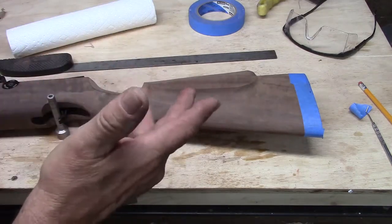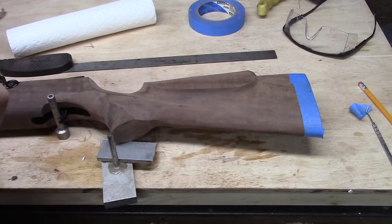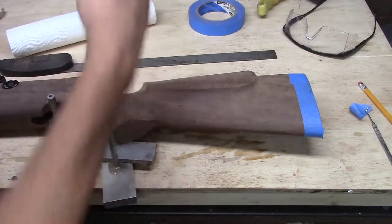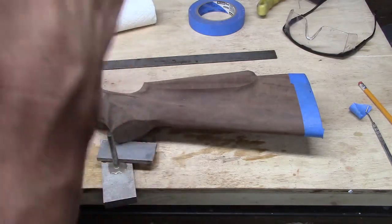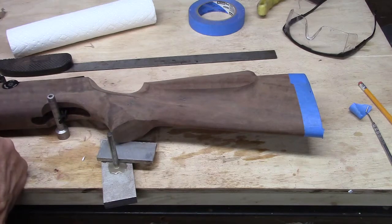It'll usually burn it. Anytime you pause with the saw, it's going to burn. The only way a saw blade in the wood stays cool is if wood is being removed. So I keep the saw in constant motion and go back and forth, back and forth, back and forth, very gently going down through the cut until it's all the way through.